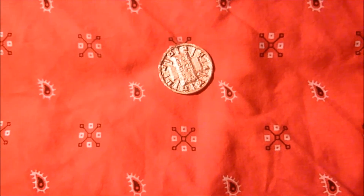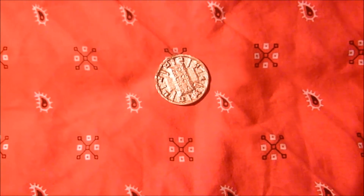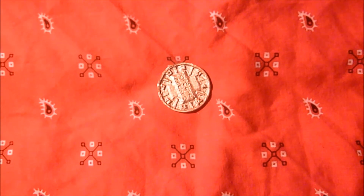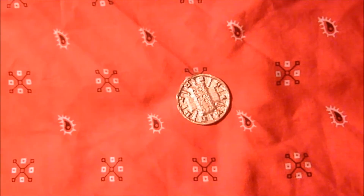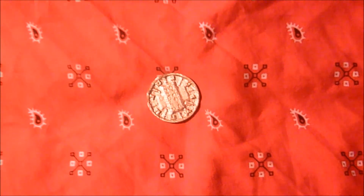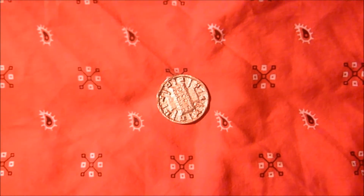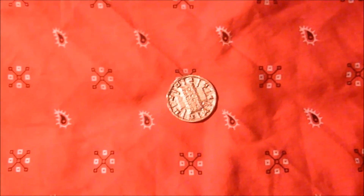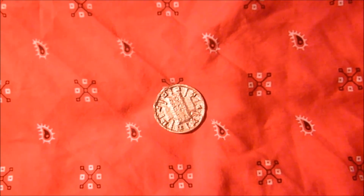The bismuth makes it machine better, and it also makes it tarnish a lot slower. The bismuth in this metal doesn't alloy like you would expect tin or anything else to do. In the liquid phase, the bismuth will stay dissolved in the copper, but as it solidifies, the bismuth actually crashes out of solid solution and stays liquid, and little globules of it form at the grain boundaries of the metal.